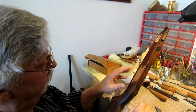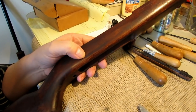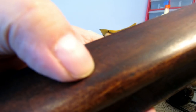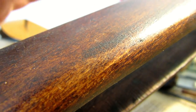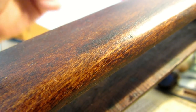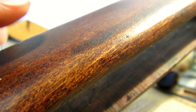We still have the question of some minor repairs, like this dent. Once it's all scraped, we scrape that out. One of the ways to fix a dent — if it's a dent and not something scratched out of it — is you just sweat it out. Take a cloth, fold it over several times in a washcloth or rag. Get it nice and wet, wring it out, lay it on there folded over maybe three times, and apply heat to it.